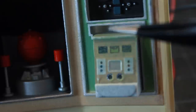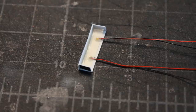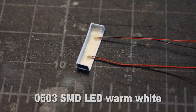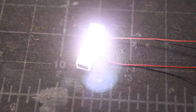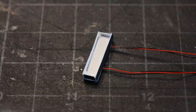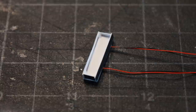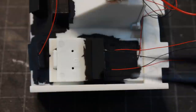Next update: I've got the copy translator here, and in the later seasons this section actually had a yellow light in there. So I've made this little light box - I put two SMD warm white LEDs in there with a little orange gel to give it more of a yellowish glow. Then I put a piece of paper to diffuse it, finished up my light box with another side piece, and glued it in place to shine straight through the plastic. Here's how it looks when it turns on - with the warm LEDs and the gel it gives it a nice yellow look.